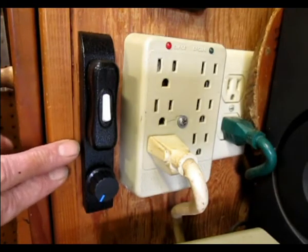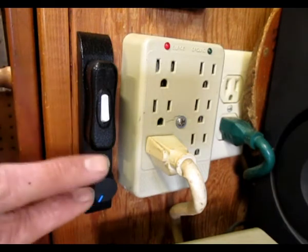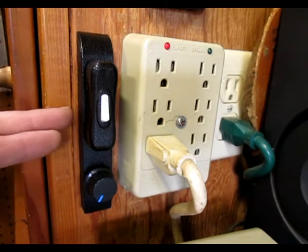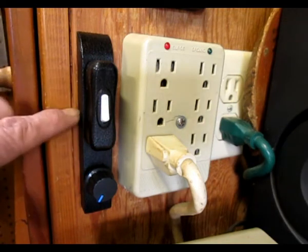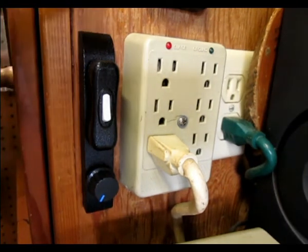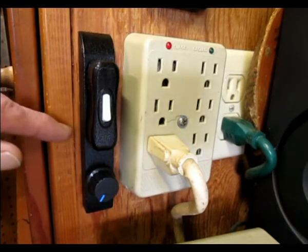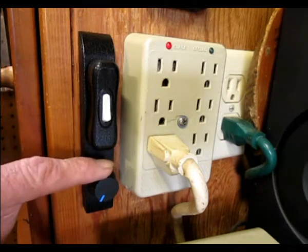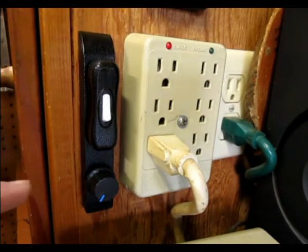I wanted to show the switch. I decided to use the switch that came with the kit, but I wanted it out here where I could get to it, along with the rheostat for the brightness. So I mounted it to this piece of aluminum channel that I shaped. The wires from the switch go through the back, and the wires for the rheostat go through as well. The lights are inside the cabinet, and the speed controller — the light dimmer — is on the other side of this piece of plywood. Just the rheostat is on this side, so the wires from the switch and rheostat go through the plywood back to the appropriate sources.